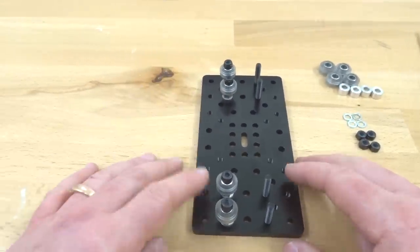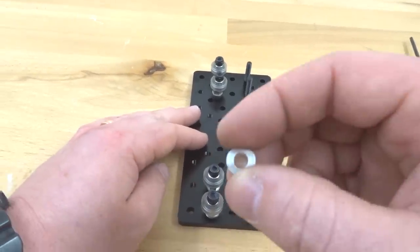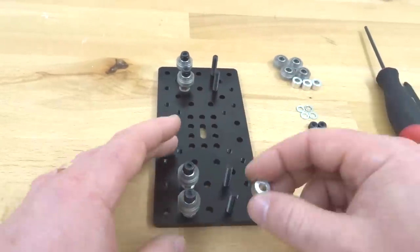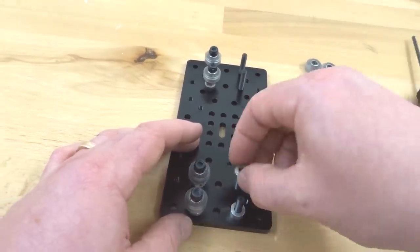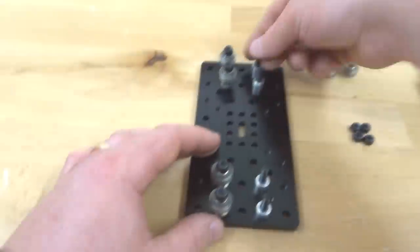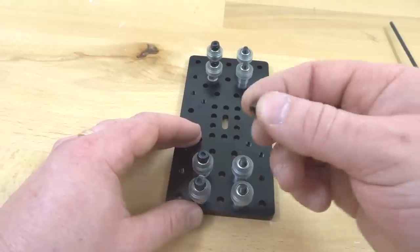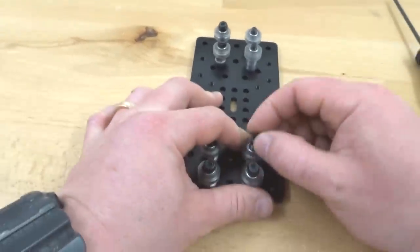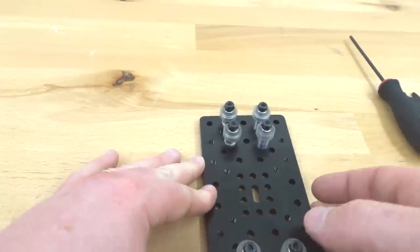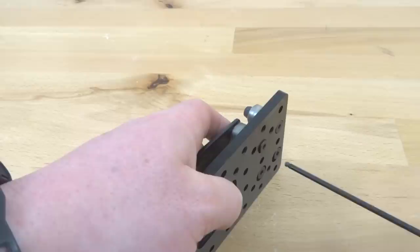The left side, which is our eccentric side, is complete — all we have to do is tighten it down. Moving on to our right side, we're going to add our aluminum spacers — this will be our fixed side. Make sure you grab your 6 millimeter aluminum spacer and put that on all screws on the right side, followed by our mini V precision shims, then our extreme mini wheels, and thread on the black nylon hex nut. Tilt this to the side, make sure to grab your spanner wrench, and tighten down all these screws.